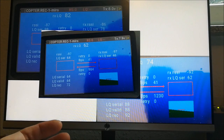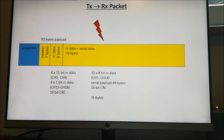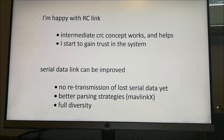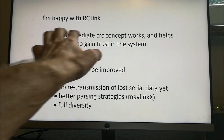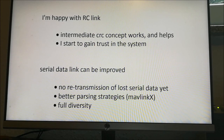What I'm doing is using a complete data packet with header bytes, then the crucial RC data, then more RC data and the CL data. I have an additional CRC which allows checking the validity of just the RC portion of the data. Obviously we get more frames where just that data is valid compared to frames where the complete data is valid. This experiment shows that whatever the true explanation, it seems to really work — it's a substantial improvement. It compensates for having large packets by effectively giving behavior closer to having small packets. I'm really quite happy with how the RC link works.